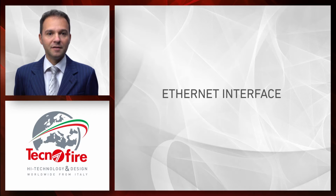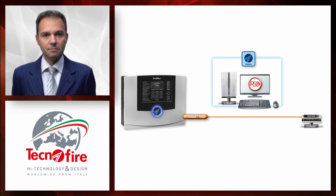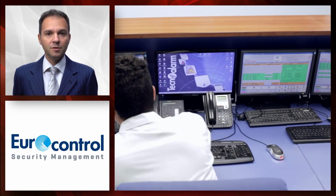The Tecnofire TFA2 and 4 control panels are equipped with an Ethernet port for both LAN and WAN connections. This network port allows to upload and download the system programming. It also allows to remotely manage the system and to access the RSC parameters from the monitoring center. The port can finally be used as an Ethernet communicator, for example, to notify the security company any alarms, failures, and out-of-service points using a contact ID, SIA, or Techno Alarm protocol in full compliance with the EN 54-21 standards.